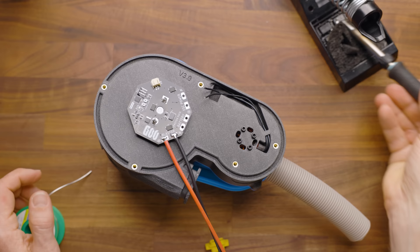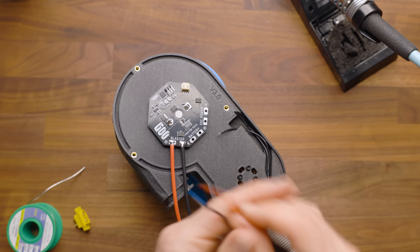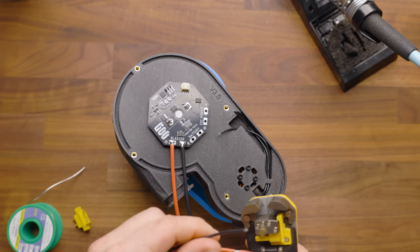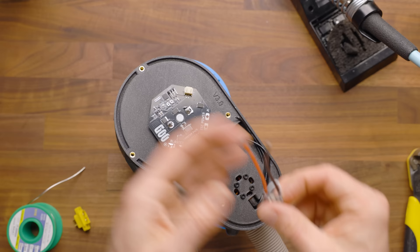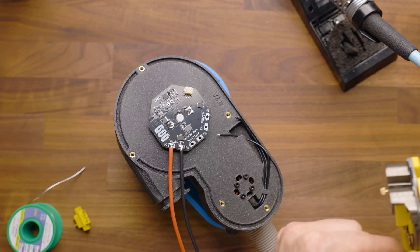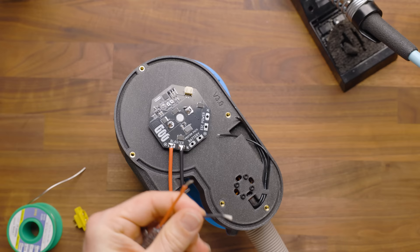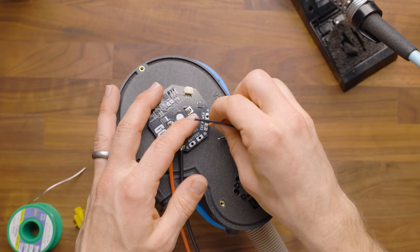So that's it for that side. While we're here, I'm going to go ahead and solder in our ESC power. I'm going to strip just a little bit — I might actually trim these up. This is ultimately going to sit right down in here, so keep that in mind. Now, the ESC power literally doesn't do anything magic — it's just a convenient place for you to solder. The reason I didn't want people to have to splice and merge and deal with that sort of thing. Since these are a lighter gauge wire, they are going to slip a little bit more, but I'm still going to do the same method.